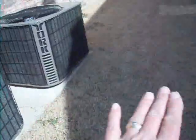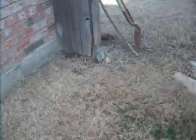Here we are at the right elevation. Again, the grading's good. All we're looking for is sloping away. Mentioned this already, you want to put extension pipes on your downpipes. And then in the back, we've got a slope away from the house. We've got a swale here. It's going to drain in this direction, out of the yard.